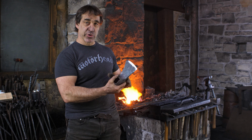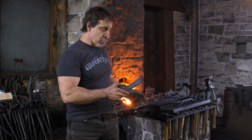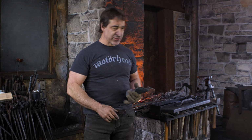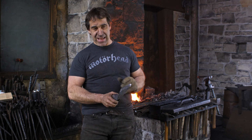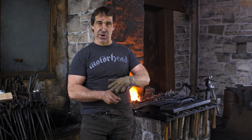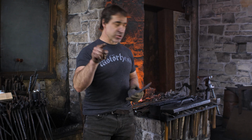Now we're gonna do the heat treat old school in the forge there. So I wanna heat it up, bring it up to critical temperature, and then we're going into the quenching oil. Quench the edge and then let the heat bleed out to create the temper heat, and then we will do our second quench into the water. Exciting stuff, kids, I know. Let's do it.